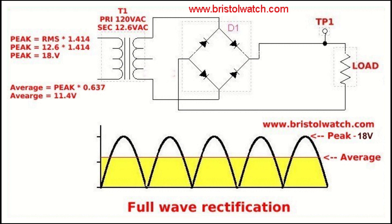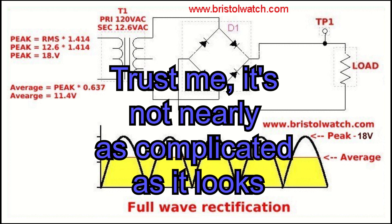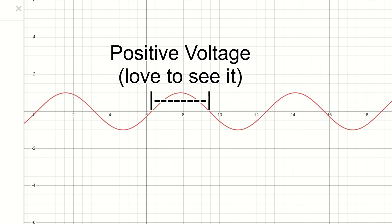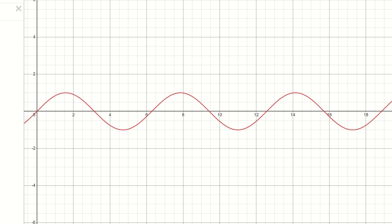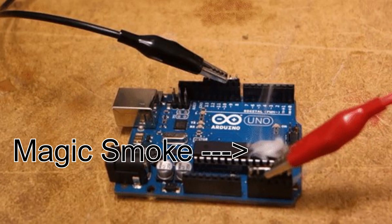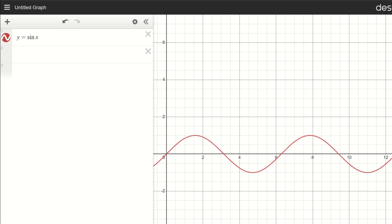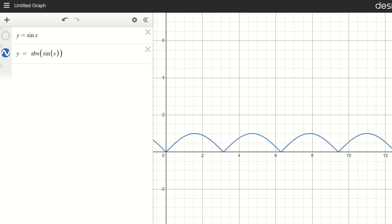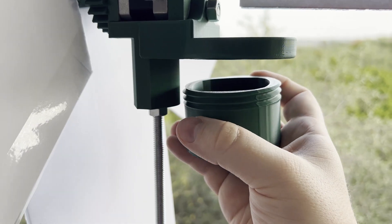The process of converting this alternating current to direct current is called rectification. Looking back at that plotted graph, you can see that sometimes the voltage is positive, but then the same wire that was just carrying positive voltage is now carrying a negative voltage. That's no good, as that would probably fry a lot of components. Using math, the way we might fix this is by putting the sine wave function inside of a function that takes the absolute value — that way, when the voltage would have gone negative, it goes positive again.